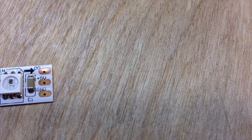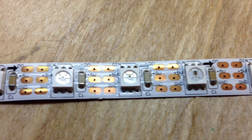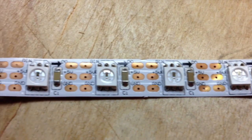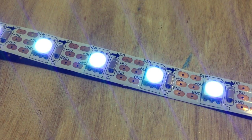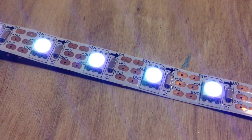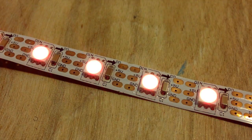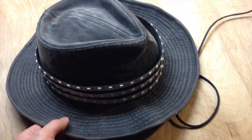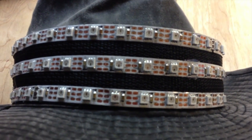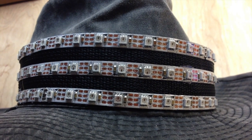So, how'd I do it? I've been experimenting with these WS2811 LED strips. I had these on hand — they're really cool. They have the controller embedded inside the LED, so you get a whole bunch of addressable LEDs on a single strip, with no external components other than a capacitor and only one data wire. I attached a whole bunch of these to a hat with hot glue, nylon webbing, and just tried to get them as evenly spaced as possible.